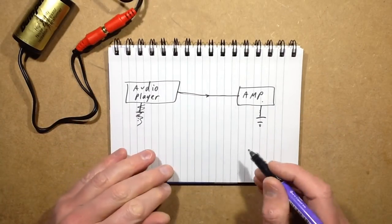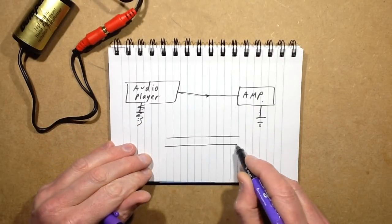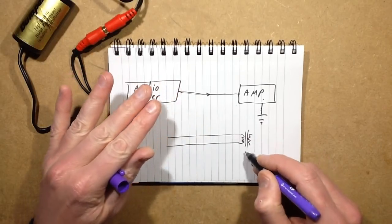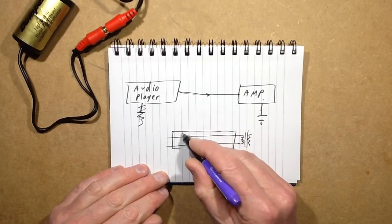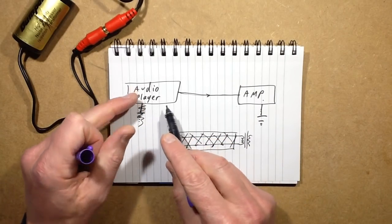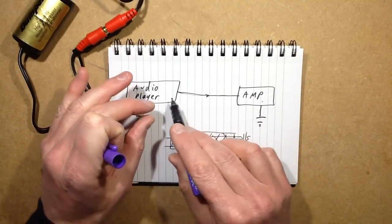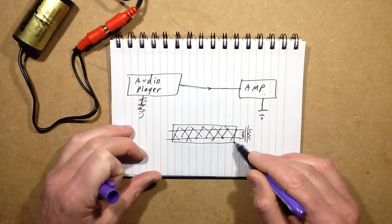Now, in professional installations, they use what's called a balanced audio signal, which is actually two wires with often an inductive coupling, a little transformer on the input, so completely isolated from the chassis. And then they'll have a screen around that. And even then, you can get audio issues caused by high current flow between, say, two separate parts of the building, even different substations, which is a very tricky area. You can get quite high current flow even along the audio screen, and that can cause problems. So one of the techniques around that is what they call lifting the ground.